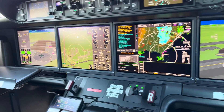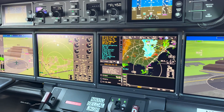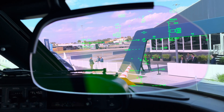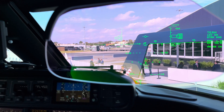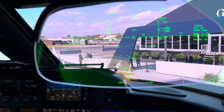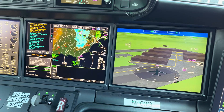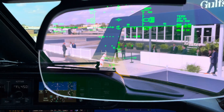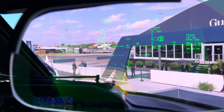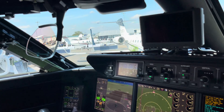What's the purpose of the dual HUD? Usually it's only the captain's seat that has one. Great question. We were initially unsure whether we'd need a HUD for the pilot not flying. We also have both synthetic vision and enhanced vision. Enhanced vision is the EO camera used to get credit to land below 200 feet by using runway lights when you don't break out visually. Synthetic vision shows all the terrain outside — mountain terrain, runway lead-in lines, the runway — giving you a lot of situational awareness, especially in the mountains at night or in foggy, smoky, or hazy weather. All pilots, to a person, love the HUD in the right seat even when they're not flying.